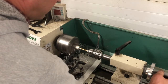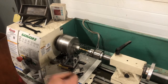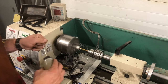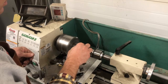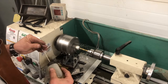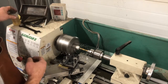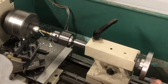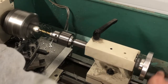Back it off, go in a little bit, back it off. Now I would also use oil when you're doing this — get some cutting oil, put it on your twist drill. I wouldn't put it on your part or in your part because that's just going to fly everywhere and get all over you. Trust me, I've ruined shirts because of that. So put it on your twist drill, and then go in a little bit and come back, a little bit more, come back.